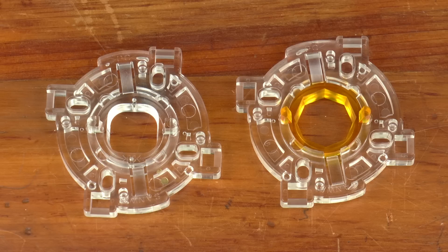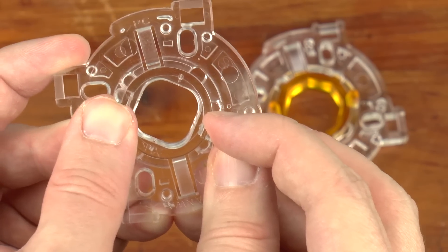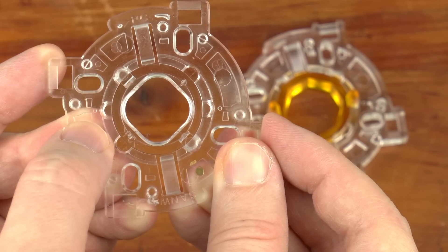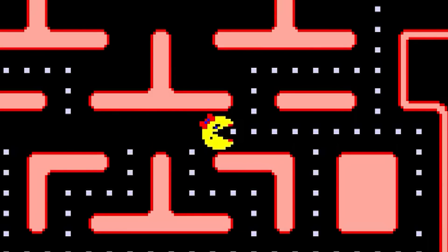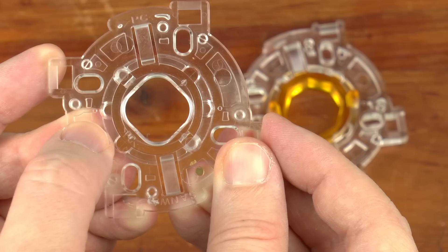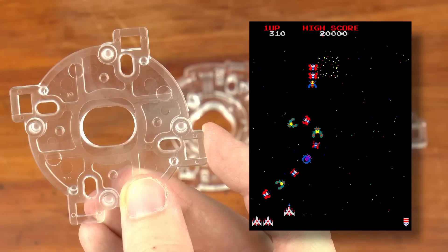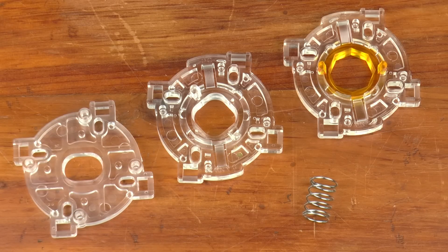It is a default of sorts. An octagonal gate restricts joystick motion and provides a wall at the corners. The square, octagon, and circle gates are often discussed among fans of fighting games as each person finds their comfort zone. There is no right answer — each gate still provides eight directions, some to a greater degree than others. But what if you wanted less than eight directions? This Sanwa gate has the ability to change from allowing eight directions to only allowing four directions by turning the square 45 degrees. The Pac-Man family of games, maze games, are a prime example of four-way use. Have you ever played Pac-Man and missed a turn because you pressed up-right on the way to pressing up? A four-way gate would help for games like these. Two-way gates also exist — Galaga is a prime example, as are games made for the Space Invaders family.